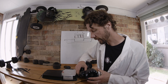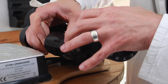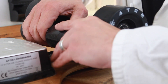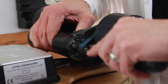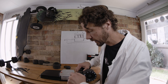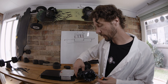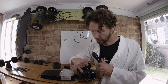So you're going to be doing this kind of by feel. If you're pushing out on your motor really hard and then you tighten those guys up, that's going to make your belt super tight. You don't want it that tight — you just want enough to stop the slipping. What I find is just using a finger: if you're not exerting a ton of pressure but just pushing it to where all the slack is out, exerting a little bit of pressure, that's pretty much where you want to be. Because the inside ones are difficult to get to, do the outside ones first. All you really need is two screws — get those two outside ones locked down. Once you have that, you can let off the pressure you're putting on the motor because now it's locked in. You can go and test your tension — taking a pinky, that's about the perfect amount.